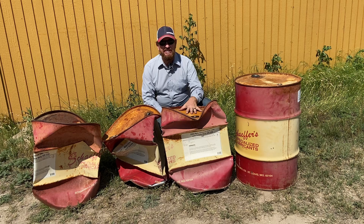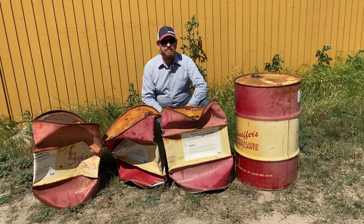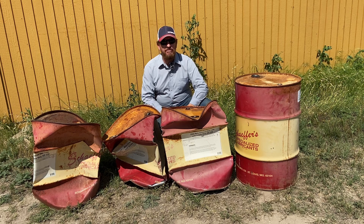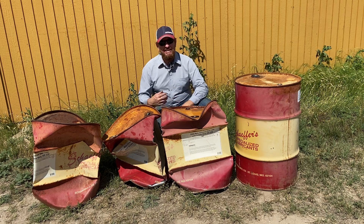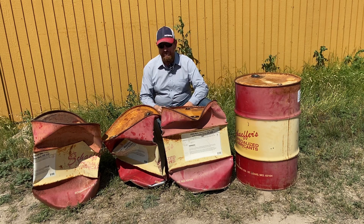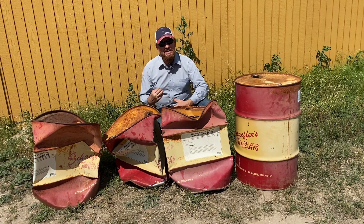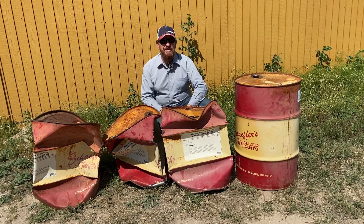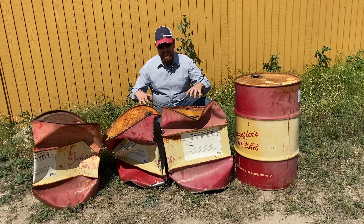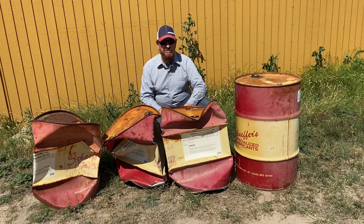What's even more important than this is dehydration. Dehydration is very important, and the size of those hoses are going to make a big difference for us to achieve that dehydration. If you saw the two hoses that we had — straight to the vacuum pump — it pulled down a whole lot faster. Unfortunately, the barrel we used was leaking and it actually pulled holes into the barrel itself, so we weren't able to crush it down as much as I would have liked. But you can still see how much faster it was. Those hose sizes are going to play a big part in pulling a vacuum — it's not just removing the molecules and the pressure difference; it's going to be for dehydration, so stay tuned.